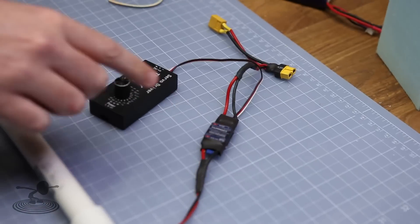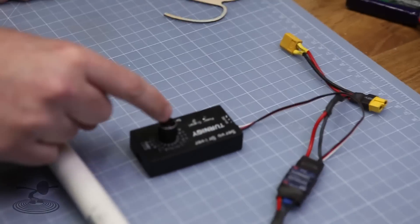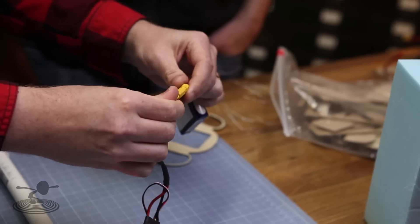What you can't do is just apply full voltage — it'll get really hot. We want precision and a certain amount of heat so we can get a certain speed out of it. That's why I'm using a brushed ESC to control the amount of power going through the wire, and a servo tester to set the temperature by pulsing the output. Brushed ESCs are really hard to find these days, but if you have one they're awesome for things like this. I'm just using a two-cell battery here.